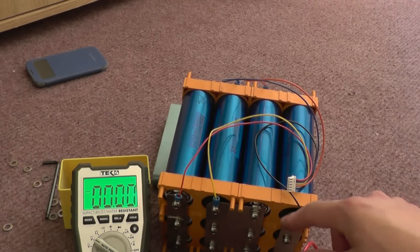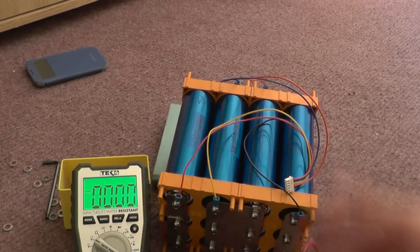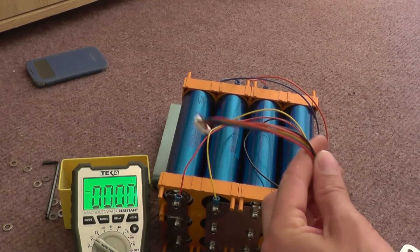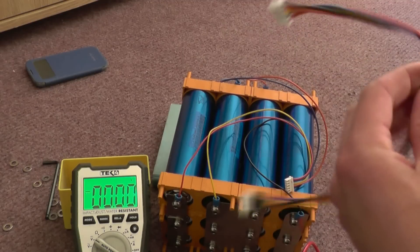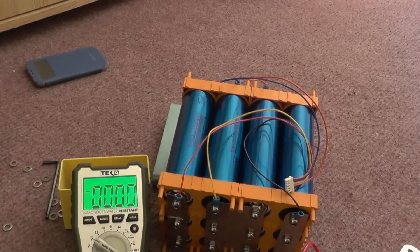I'll double these up so I've got leads going from beginning to end: red, blue, yellow, orange, black — and I'm gonna do the same again. So I'll have two sets of leads — one going into quick-release connectors, probably WAGO ones — and depending on whether the BMS or the printed circuit board monitor needs two, three, four, or five leads, I'll have a spare set ready. I've already got one in stock, just waiting for another part to come so I can connect them together and see if it cuts the charge off when it should.